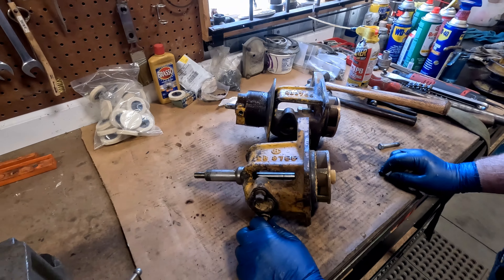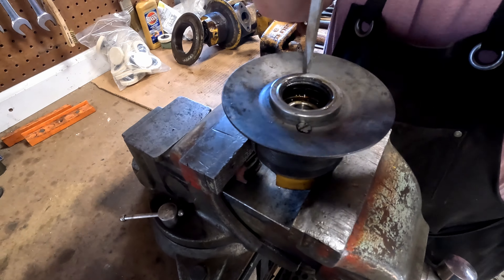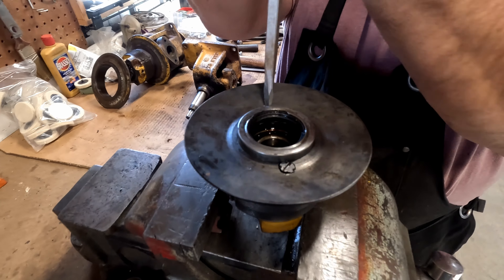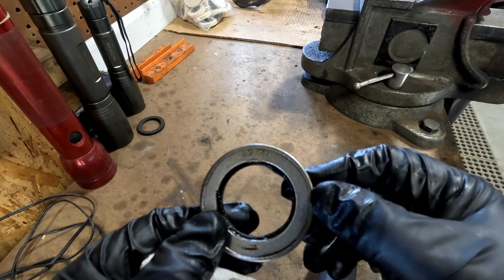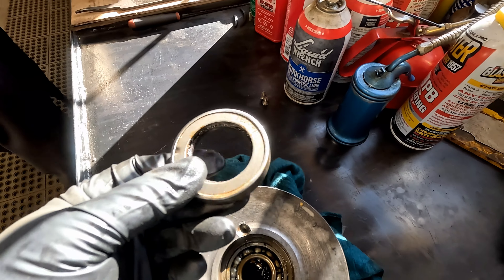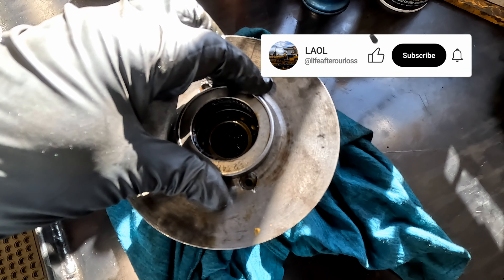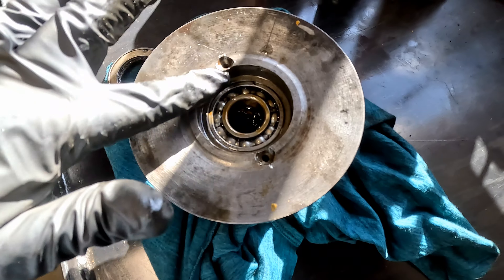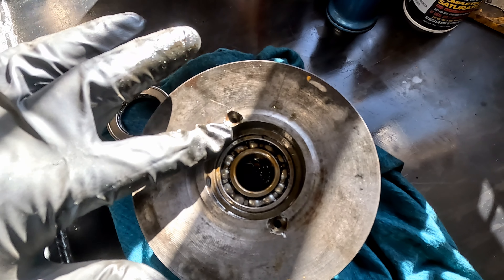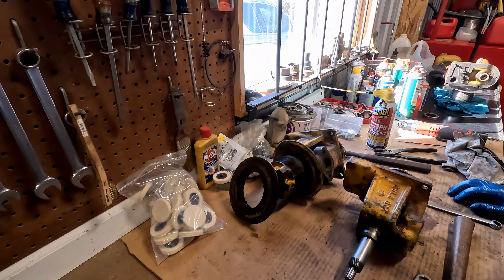We might want to mix and match our parts here. They're staked — they're keepers for this seal, a 1B2346. Looking at the seal, that's the wrong part number — not what's in the book. This seal is supposed to install all the way down flush, but when we took this apart it was clear out. I think it installs flush and then two pan-head screws that are staked hold it in. So that was off of our 4G water pump.